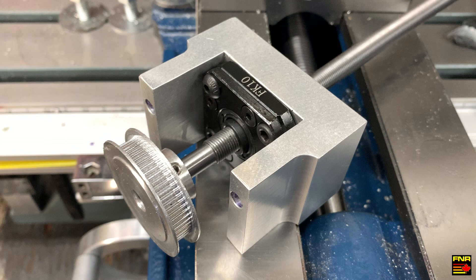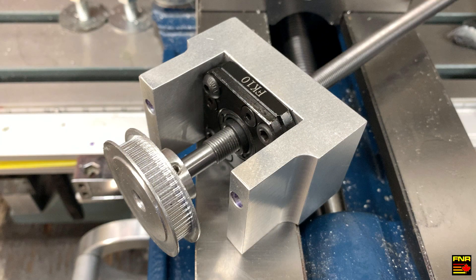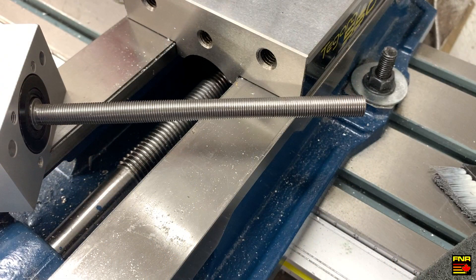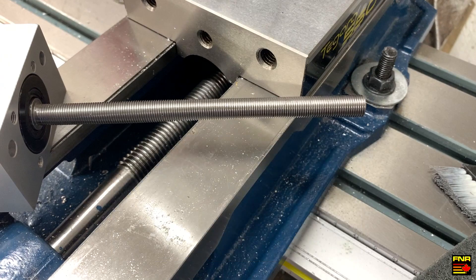So the natural next step would be to go ahead and find a ball screw to replace the lead screw that was used previously. Unfortunately, there's just not enough room inside the cross slide to fit a ball screw of any manufacturer. There's very, very little room in there, and that means I'm left using the M10 by 1.0 thread that the original lead screw uses. So I cut up this shaft that you see here, and because I don't trust single point threading on my lathe yet, I did it the hard way and cut the threads on with a die — and that was a disaster.